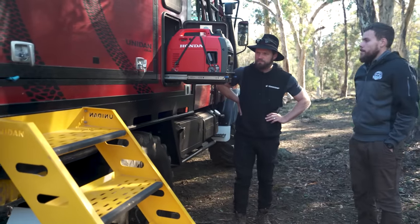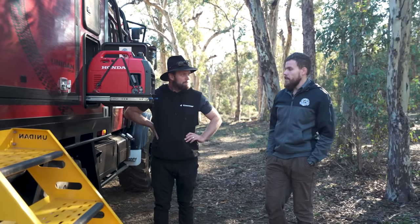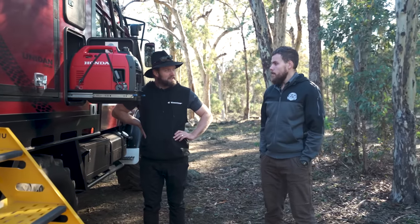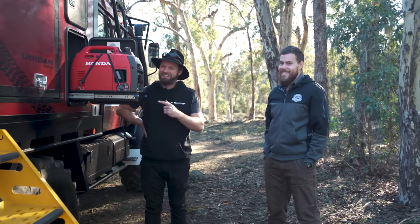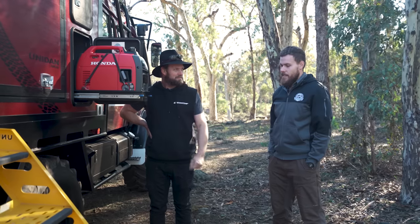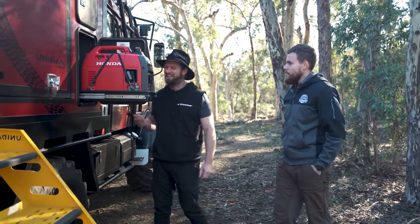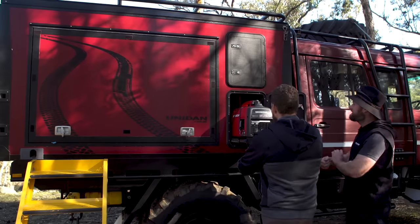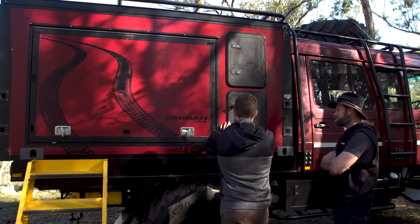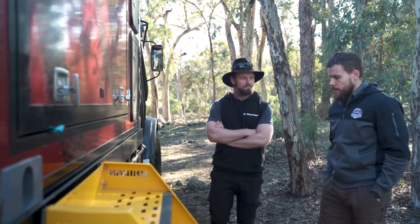Neat. It also runs a reverse osmosis water system that I carry sometimes with me, so we can turn salt water into fresh drinking water. So you have a desalination plant with you in there. Yeah. So you could camp indefinitely so long as you got food. Yeah, you'd have fresh water all the time. That's awesome. Desalinate. How many liters can you do per hour or whatever? I think it's about 150 liters an hour.